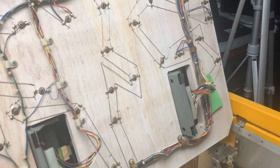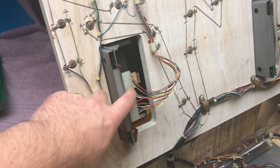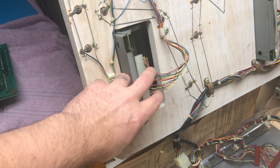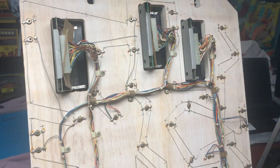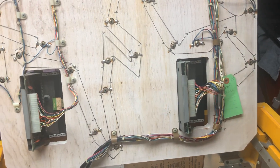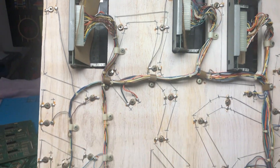I took one out and found a couple of bad solder joints — cold solder joints. In my last video I said they just get dried out, but that's not accurate. It's from the connectors being taken off, vibrations from the machine, and just years of pinball abuse. The machine gets shaken and you do get cold solder joints. A lot of these boards just have solder joint failures.